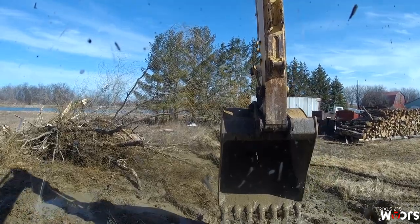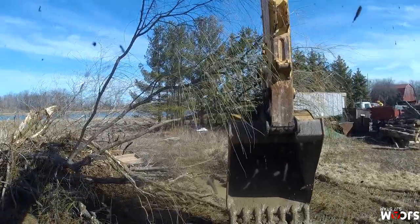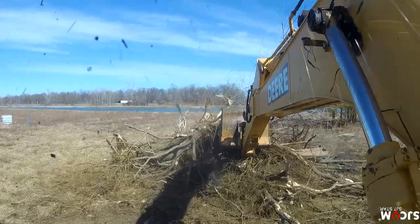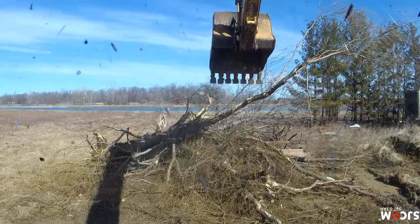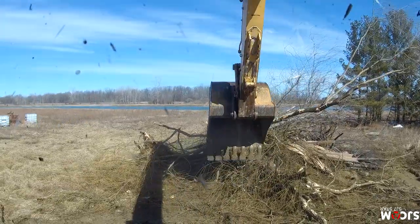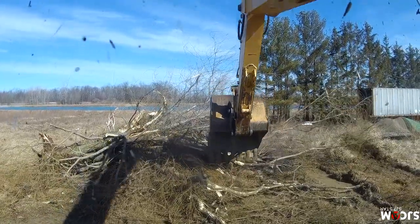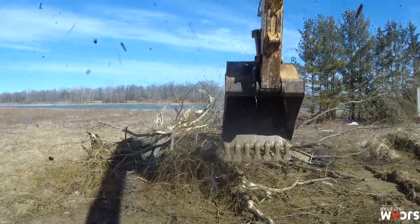So anyway, I ordered these parts. They took like a week to get here, not a big deal. Pulled them all out of the box, and now I have something at least to compare to, right? Going through, I can't see anything that's different. I actually pulled out a digital caliper and started going through, and I measured 20 thousandths of a difference on that brass plate, right? So I'm not super excited or thinking, hey, eureka, I found it. But we got the parts, so we're putting them in.